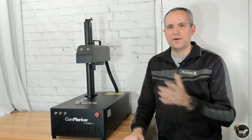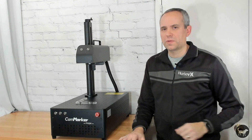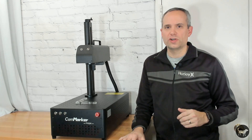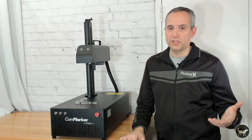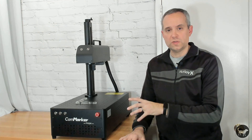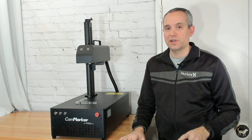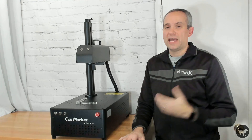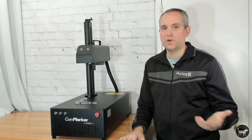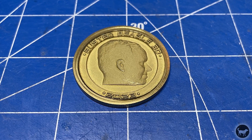Overall I was very happy with how this machine functioned. I'm not going to lie and tell you that all of this is easy — fiber lasers, and even more so with Mopa functionality, do have a slightly higher learning curve over your standard diode or even CO2 laser. However, if metal marking, engraving, or cutting is what you want to do, you really can benefit from one of these types of lasers. There is also a great resource for learning how to use this type of machine over on the Laser Everything YouTube channel — there you will find extensive tutorials and explanations, as well as power and speed libraries that can really give you a great starting point. Now this is not a cheap machine, but you don't have to get the 60-watt if you don't need that much power — I have made those 3D coins with a 30-watt laser which may have taken a little bit longer, but it still gets the job done.